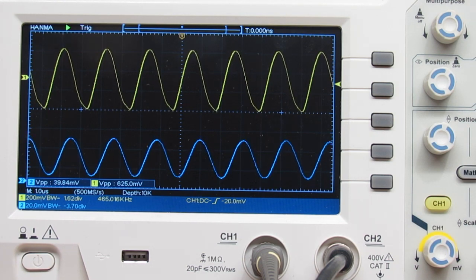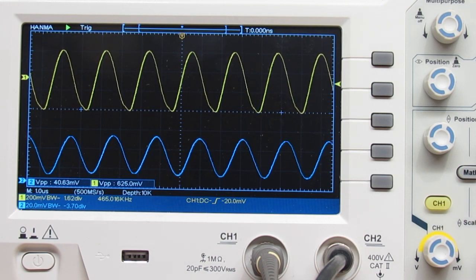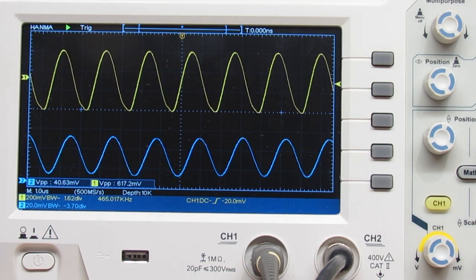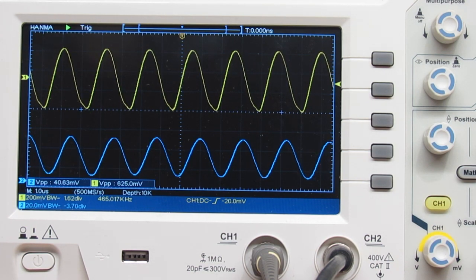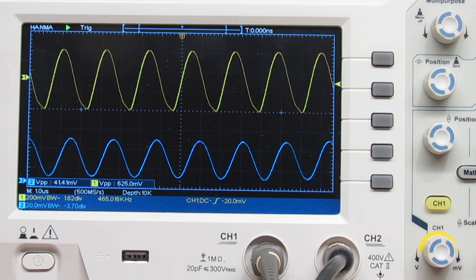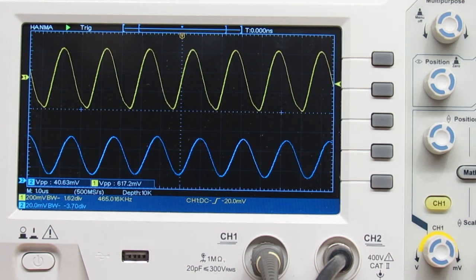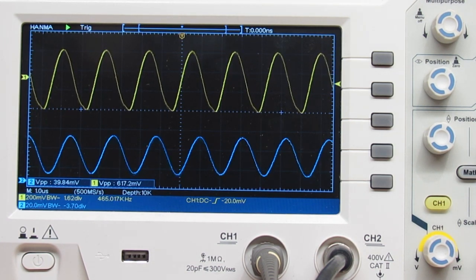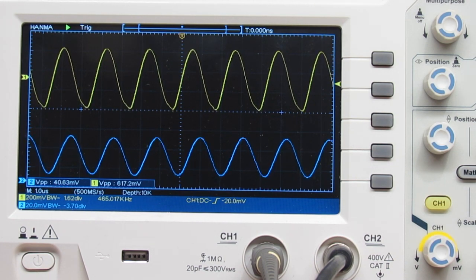What's happening is the automatic gain control. The ideal radio gives a constant output volume for all signal strengths: if the signal is weak, the amplifier gain increases; if it's strong, the gain shuts down. So before going further it's worth working out what to do about the AGC, because if I measure the frequency response while keeping the input constant, I don't really know what the output means — it all depends on how the AGC is set.